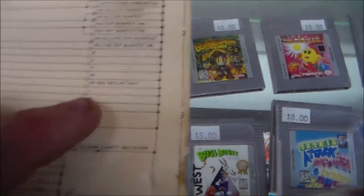Here we go. All right, I found it. It was not in vain, people. Hundreds bell. So on the schematics, here's the hundreds bell. Now the way the hundreds bell gets its power is simply through our buddy, the L relay. The same one that I had a misadjusted switch on must have another misadjusted switch. So the way you can find it is you can look at the color. It says slate and green, or that might be slate and gray. And then on the other side, it's connecting to the red and white, they call it. So slate and gray, red and white.